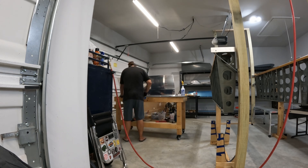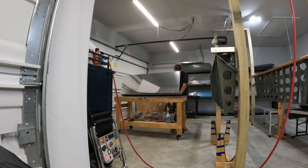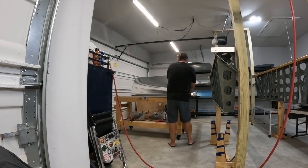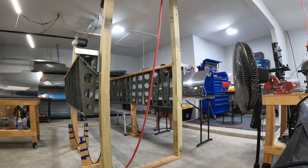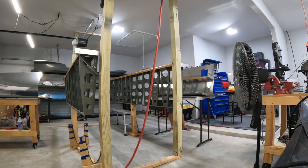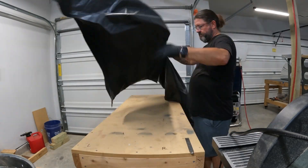I won't do anything on the tanks for a few days — I'm going to stick with getting the leading edges built. The sequence from here: get the leading edges built, cleco the main skins on, then dimple the main ribs — at least the top side. I won't dimple the bottom side yet because I'll wait until the bottom skins have been fitted and final-size drilled. Then I'll dimple the tops of all the ribs with the squeezer, and do all the remaining countersinking on the flanges of the main spar.